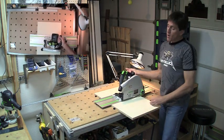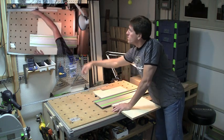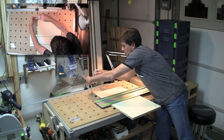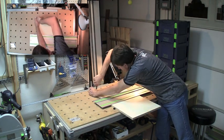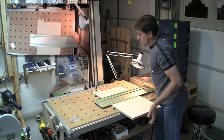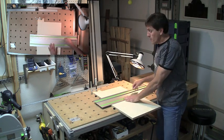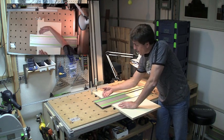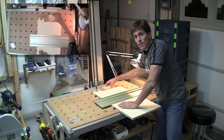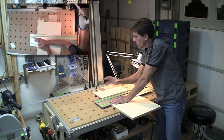For repeatability, all you need to do is take a small square block and put it back there. Just clamp it in place nice and tight. I would actually stick some sandpaper on the bottom of a block if I was doing this on a regular basis, to make sure it does not move when you bump it. Now you can make the cut, slide another piece in, make the cut, slide another one in — you could do that all day long. For cutting narrow pieces, you can make a stop block that simply reaches underneath the rail. If you're doing sheet goods, take a scrap of the same sheet good because it'll at least balance the rail a little bit better.